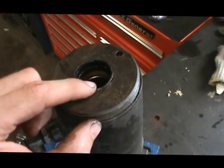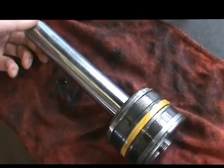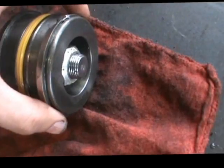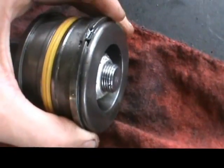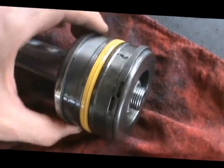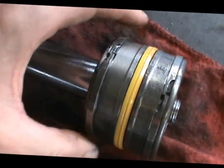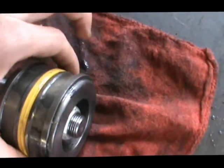They don't usually leak at the barrel, but they often leak at the shaft seal right there — that's where the cylinder goes up and down, so you get the most wear. Here's the cylinder rod — the ramrod. Basically like piston rings: it's got a compression piston ring. Fluid gets pressed this way or that way and has to go somewhere. This other ring here — same kind of thing — these wear out sometimes but not usually. There's your other nylon seal.